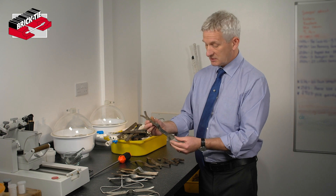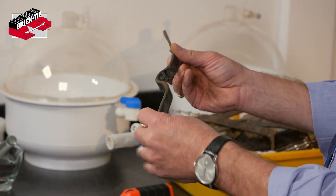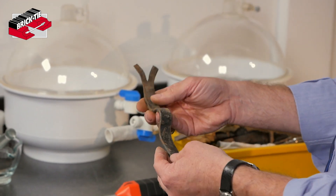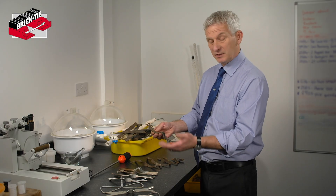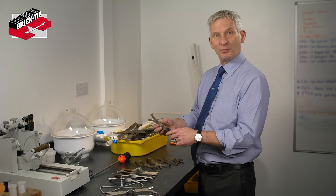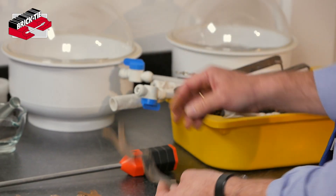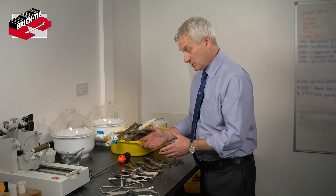Not all ties are galvanised. Often, especially with pre-war properties, they're dipped in black paint — some people call it black Japan. They come in various shapes, sizes, and thicknesses, and they have a finite life as well of course because paint peels off. Just as you might find hammerite peeling off a gate after a few years, the same thing happens here, and it's inevitable the corrosion will continue from that stage.